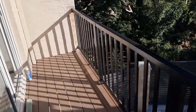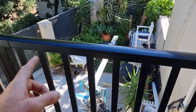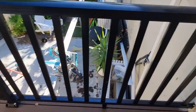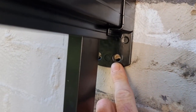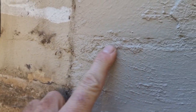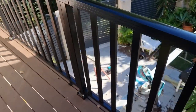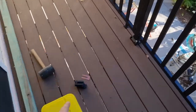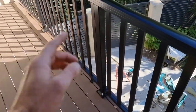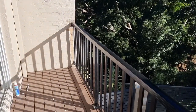I'm going to start off by finishing off this balustrade. On Friday my dad came and helped me put that in because it was a bit tricky to slide in. One other thing I've got here is that where these holes ended up is on a grout line, so I'm just going to chemset that and do that off. But before I fully fix that off I'll just make sure my posts are level by putting plastic packers underneath, leveling it up, and then tightening it up as needed. And then that will all be ticked off.